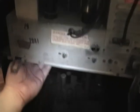I've never seen one come up for sale, and I know there are other guys out there who are looking for them, so that's kind of a shame. But otherwise, this thing is in remarkably good shape. I haven't pulled the chassis out yet, and I also haven't tested the picture tube. But from what I can see there's no rust, and everything seems to be here — including every single bolt, nut, washer, etc. Normally when I find sets the chassis are looser, with just one bolt holding them in. But on this set, every single bolt is there, same with the lower chassis, including all the original rubber mounts that this chassis floats on. It's even got some of the older-style tubes in it — the ST-type 5U4. So I'm really curious to see what the condition is underneath.